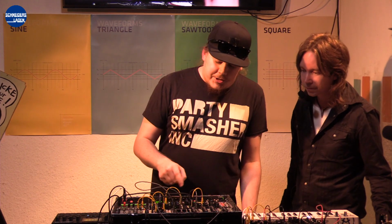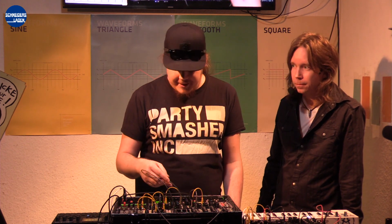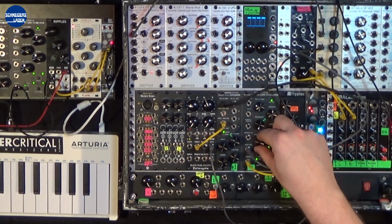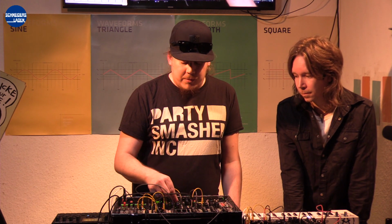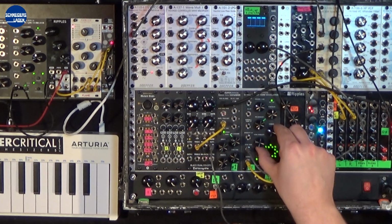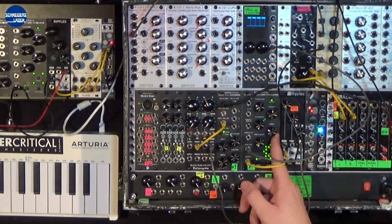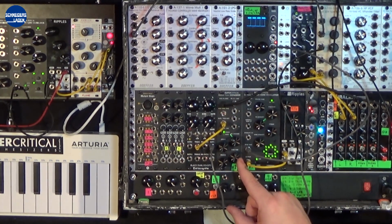Yeah, it's a sync trigger input, an analog input where all waves are synced in phase whenever the trigger hits. Technically, +5 volts on a rising edge gives you a sync. This is very useful for all kinds of bass stuff. Whenever you introduce some drift, the effect weakens, kind of smooths out. By the way, this trick doesn't require the expander. And when you have a nice enveloping effect here, if you have the expander, you can use the sync time.